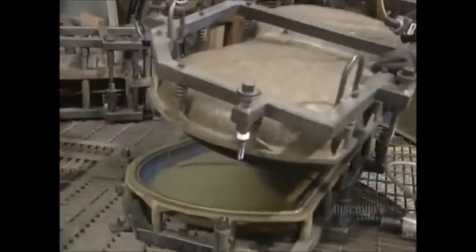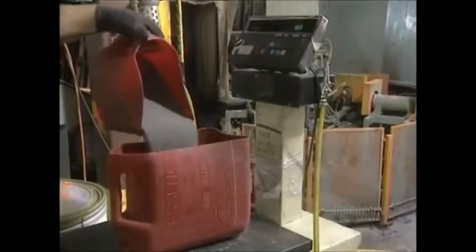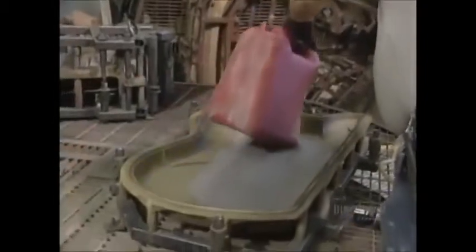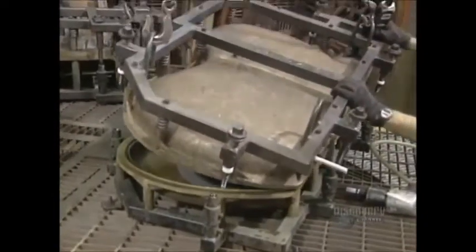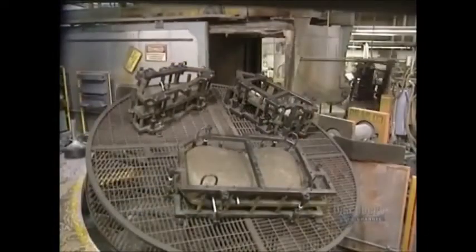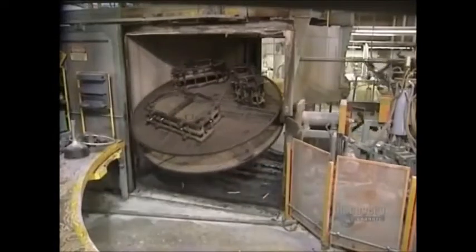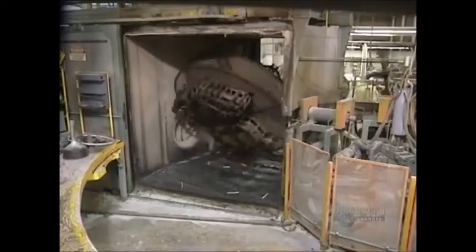There's another way to mold plastic, by rotation. This previously colored powder has a 35 mesh size, which is just a little larger than flour. Low-density linear polyethylene is poured into the bottom of the mold. The mold has a cover which will be well closed, then placed on a steel support. This support is articulated by an arm on two rotation axes simultaneously. This action allows the plastic powder to distribute itself thoroughly throughout the mold.